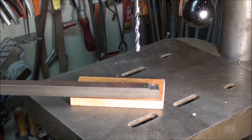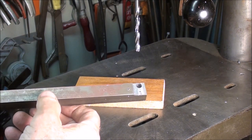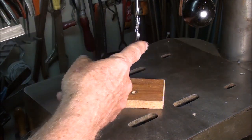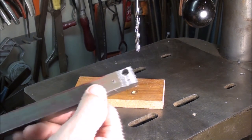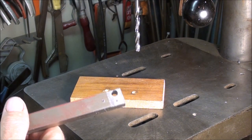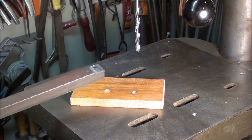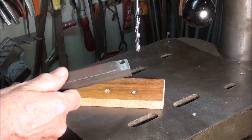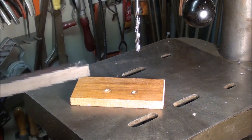Now in this part of the video I'm going to do some drilling. This is the Ledloy 300 — 12L14 — with a quarter-inch bit, not particularly sharp, just one out of my index. I've center-punched a hole there, I'm going to drill it, and then a little later we'll tap it. Notice the chip formation, the shape of the chips, and so on in this sequence. No oil — I'm not using oil on purpose.